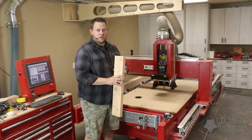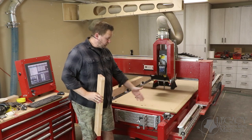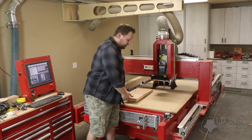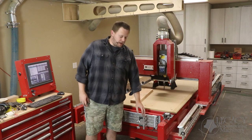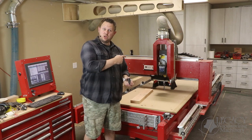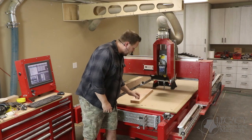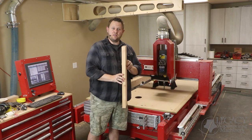For this component, we're going to be using our vertical mounting fixture along the width of the machine, the y-axis. One of the components that we added to the package of the door-making system is this custom fence that allows us to use the same clamping fixtures that we were just using in the other vertical plates. We can install this and show you how easy it is to mount this so we can machine the tenon on the end of this material.